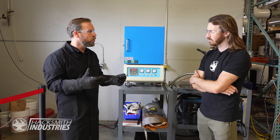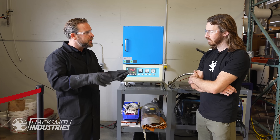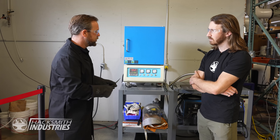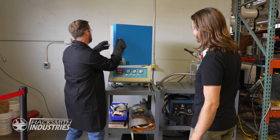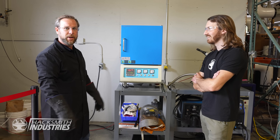Now that we have your piece cut, the next step is to program the shape into it using the furnace. But because it came from a curved sheet, if we just put it in the furnace, it's going to go back to the curved shape it was already set to. So we have to clamp it between two pieces of steel, put it in the furnace, and let it bake in there for a few minutes.